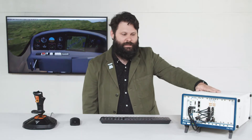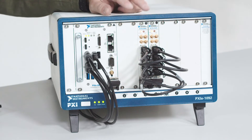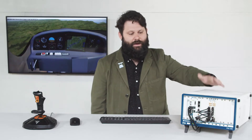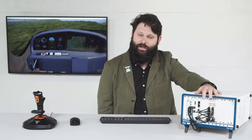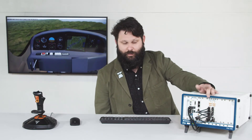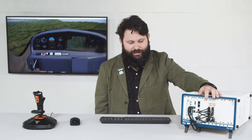This is my PXI system. In the PXI system, I have two high-speed serial instruments. These high-speed serial instruments have large field programmable gate arrays, or FPGAs, on board that allow us to put the ARINC 818 protocol on them. Since they have the protocol entirely on board, we can run in real-time, and they serialize and deserialize the information on board and send that to multi-gigabit transceivers and receive from those transceivers on the receive side. So one of these is our transmitter and the other one is our receiver.